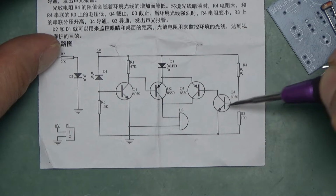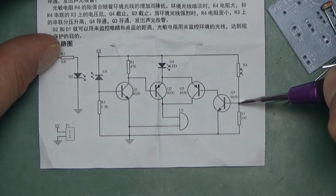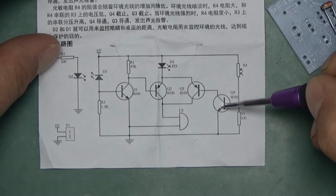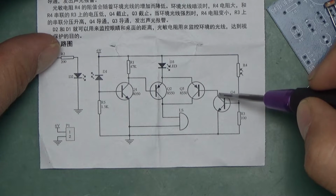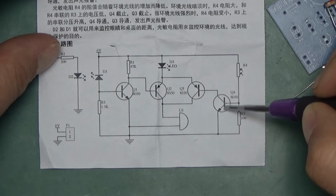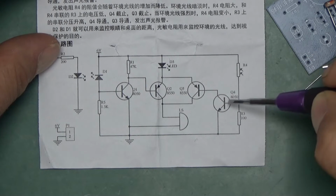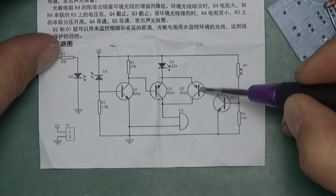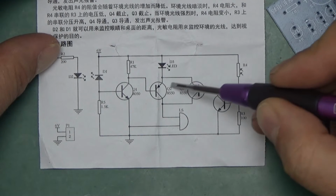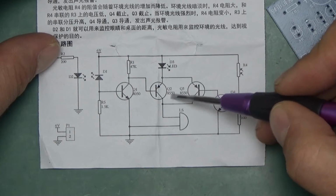switches on this transistor. This looks kind of like a Darlington. This arrangement here has a very high gain. If you think about it, each transistor has its own gain. Very small voltage on here will cause a very small current going through base emitter. If you multiply that by the transistor gain, that will be the current that goes through the collector emitter junction of the transistor, but that is directly tied to the base of this transistor. So that small voltage that's already gained by the gain of this transistor will get multiplied yet again and essentially fully switch on this transistor, which is connected to the same points as the other PNP. So it will switch on the diode and it will sound the buzzer.